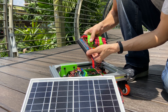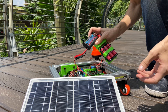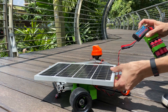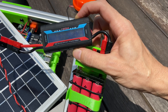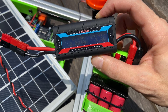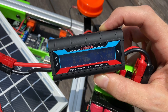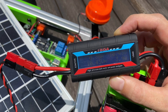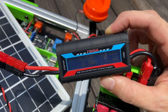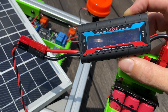Now, 5.1 watts, 10.43 volts. The voltage on my meter is nearly the same as what the battery cells said when they were disconnected from everything. We got 3.9 watts — that's probably the most we're going to get because there's nothing sitting in between this source and our load except for the protection circuit. 3.9 watts — that's not too bad. It advertises it can do 10 watts, and probably if we allow the voltage to be higher with a different kind of load, we would get all 10 watts.